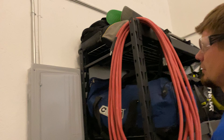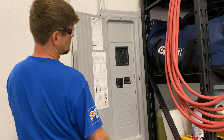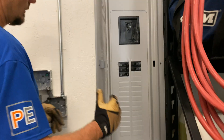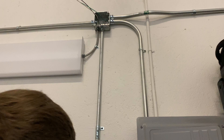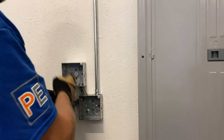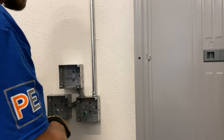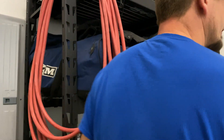When you pipe over, this is a three-phase panel — a 120/208Y system — simply piped up into here so we could deliver both ways, come back down. This is where he wanted his switches. We'll probably put in three switches and three plugs with GFI protection. He already has an RV hookup, so he didn't need that, but that was the only power he had in the garage right there.